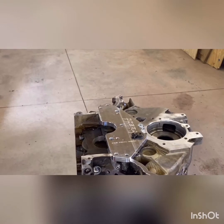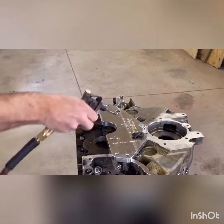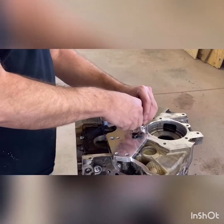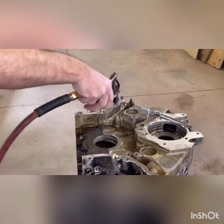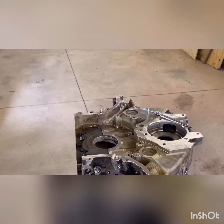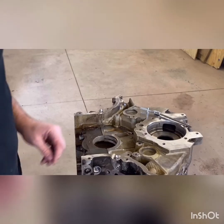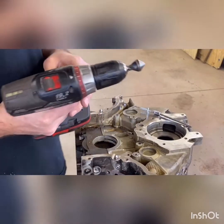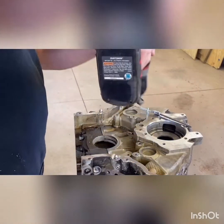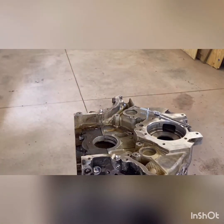My cheap drill isn't cutting it today. Drilling is all done. I recommend pulling the fixture off and cleaning those holes — all good. You don't want chips down in there blocking the tap or binding up the tap; that could make a real bad day. I'm spoiled — I got a good chamfer bit. Even with a larger drill bit you see just a nice break on that edge, give it a little lead-in for that tap. Makes it always nice and clean.